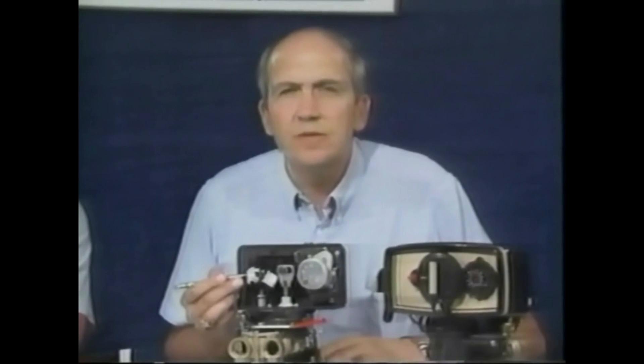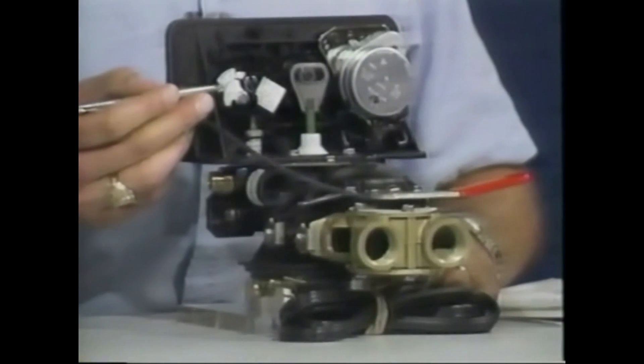For example, if you had an RO unit using water at a rate less than what the meter registers — in a sense that would be similar to having an additional person in the family, because it's using water every 24-hour period but the meter isn't counting it — we're understating the actual amount of water used, and we may want to increase the salt setting one or two pounds to compensate for something like that.